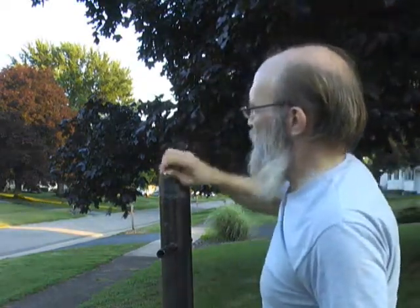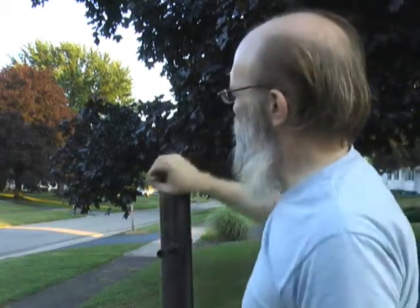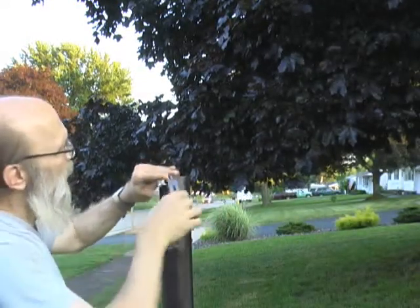Now, we'll pull this wiring back out, and we got a couple of problems. Okay, number one, we didn't cut much of this exterior insulation off. So we're going to have to do that. You should be able to separate these wires a little bit better than this. It definitely looks like it was a handyman job, something that was not put in even back in the day. A licensed electrician would not have done it quite this way. So, and again, along that score line. Wow, this is brutal.